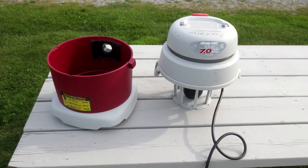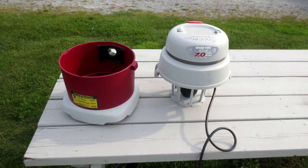Unfortunately, one of the guests flushed what appeared to be a moist towelette or wipe down the toilet, and it got stuck in not one but both of the duckbill valves. The result was that the pump couldn't keep a prime on the vacuum — it couldn't build enough vacuum to suck everything through. Given what came through afterwards wasn't quite disposable, I had to put the shop vac down there, suck it out, open it up, and pull the offending materials out. Anyway, it's all fixed and clean now.